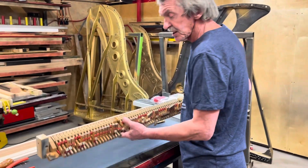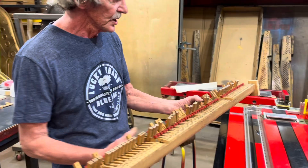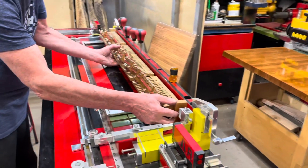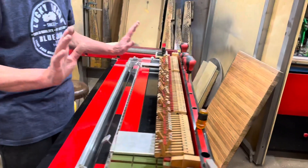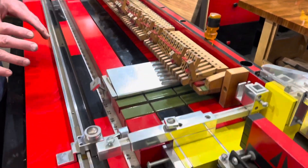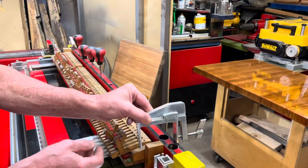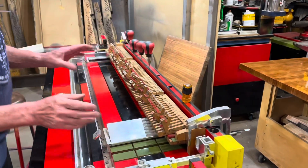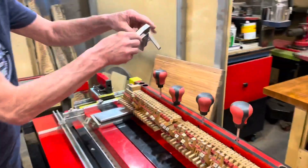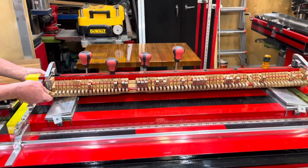Since you know already why we do it, we want to show you how to do it. The damper action inside the piano sits in certain positions on these blocks, and that's why our tool is designed so that we have a place to put our damper action positioned like it is inside the piano — on a straight surface of the belly. We position it and we have special clamps here, designed just for the blocks, so we tighten them so they don't move. We want it solid, and from the left side the same clamp — we just lock it here.